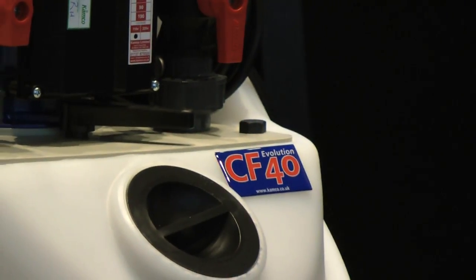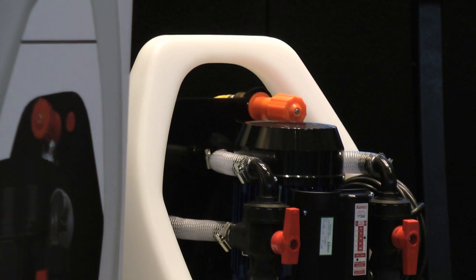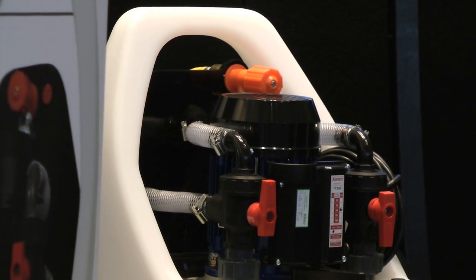So what you do, you put the full flow on the next radiator. 5 minutes or so, using the flow reverser regularly, and push on to the third radiator. And you are going to work your way right through the house like that. So if you had 16 radiators, and you can do more with that pump, you just keep going. Full flow on each radiator in turn, till eventually you're going to get to the last radiator, which is typically going to be an upstairs radiator. So you'll give it 5 minutes, reversing the flow backwards and forwards,